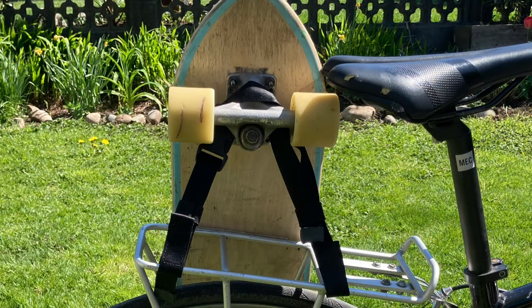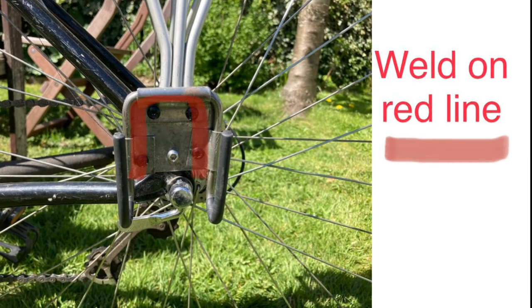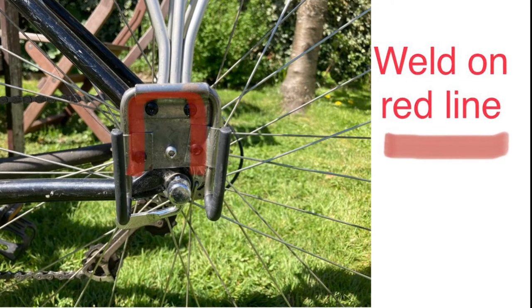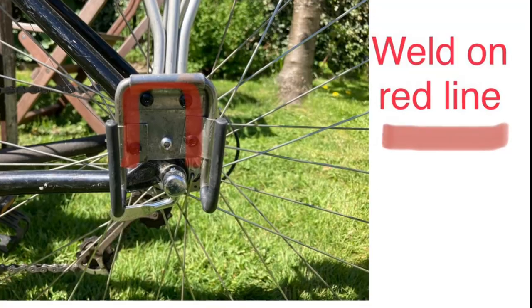To hold the board steady at the top I used a recycled backpack strap. It has velcro that attaches to the bike rack so it's removable and you can take it off whenever you want. This process of designing and prototyping is something you can apply to any project. Starting with a problem that you're genuinely interested in solving is the absolute best starting point. From there you can sketch designs, make 3D models, build prototypes, and build and improve off of each version you make. As a next step I would like to try a welded version where the hook is welded to the steel plate instead of bolted. A welded version would be much more producible and could be sold as an actual product.